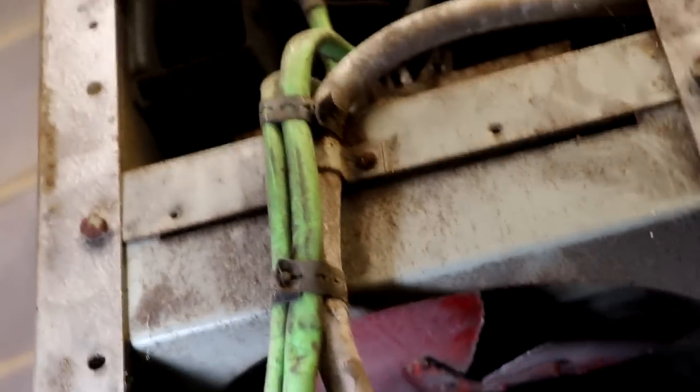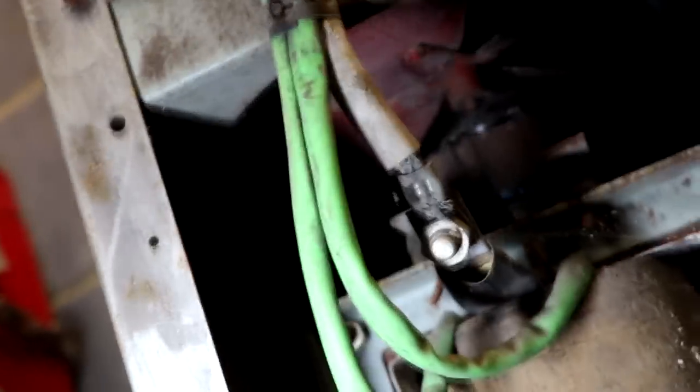That fan cooling is quite interesting. Another part we'll have to check is that we can get the fan working. The transformer itself, visually, looks like it's wrapped in some kind of linen material that's maybe been dipped in varnish. I can't see that it's burnt or rotten, so the visual inspection looks okay — I'm not seeing anything to worry about.